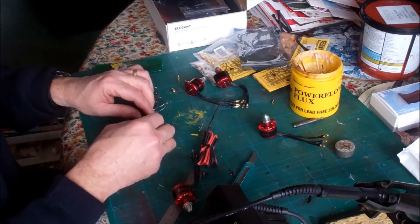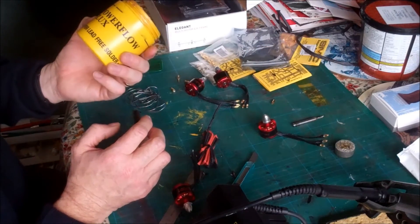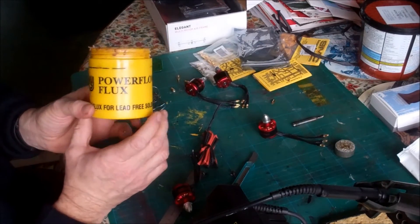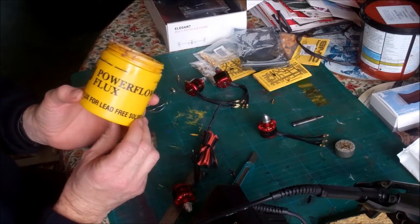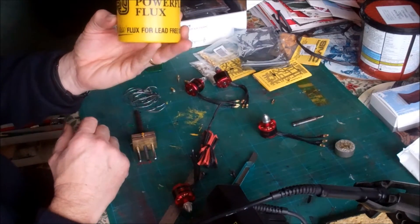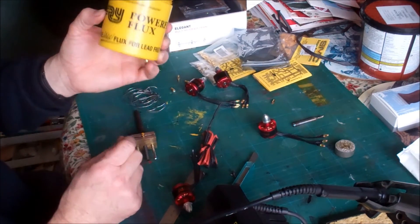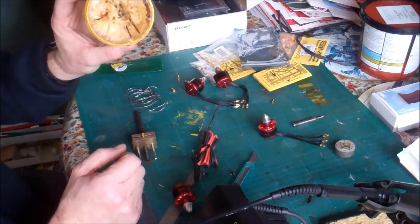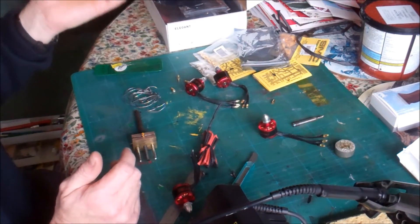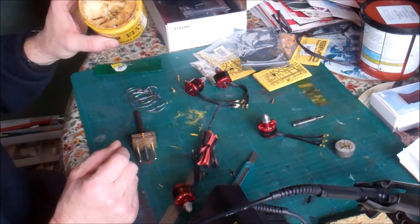Soldering on a new bullet connector now. I've just got a little flip camera that I use. For flux, I'm using a phosphoric acid flux — quite corrosive. You may have seen Baker's soldering flux in your local hardware shop. Don't put it anywhere near steel — even the fumes will corrode steel. This is just basic power flux from my local plumbers, and it says for lead-free solder but works just as well with conventional solder. Cocktail sticks go a bit manky in there after a while, but that's part and parcel of it. Flux makes the solder flow very well. I'll re-tin the wires and then hopefully show you one being soldered.